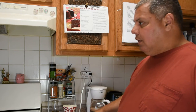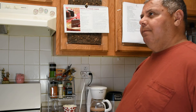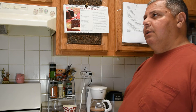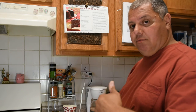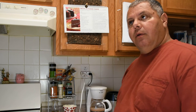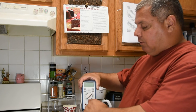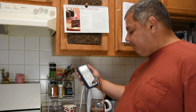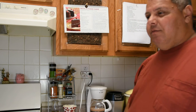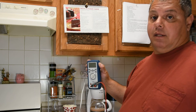At first glance this might look like a wiggy, but it's a multimeter with many more functions. Most wiggies have two leads and give you AC, DC, and continuity — they might beep and some have a digital display. Electricians like wiggies with digital displays to see their readings. Wiggies are the easiest for most people to learn. For more precision, look for True RMS — you can get True RMS meters for under $60. This is a BK Precision with a very good rating for $90.